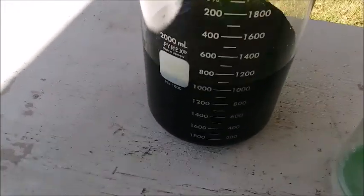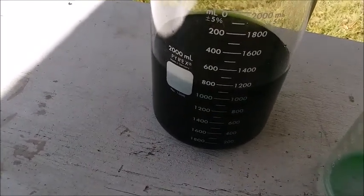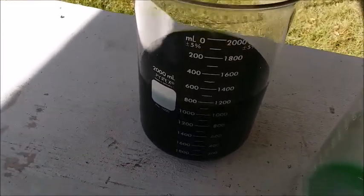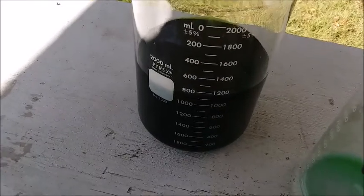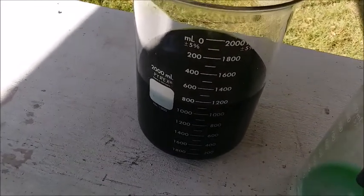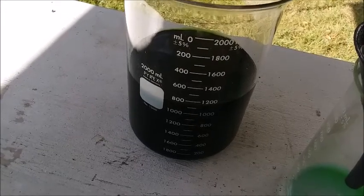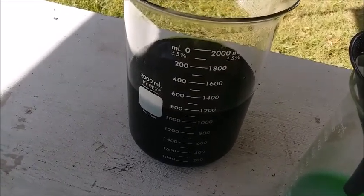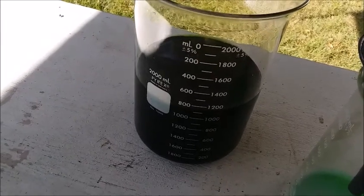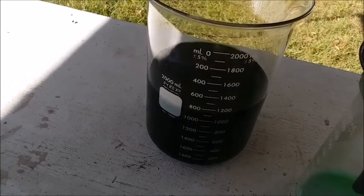I'll keep spritzing the filter until it turns white again and I get rid of all that green color. Now, this liquid — don't throw it away. A couple reasons. Number one, it's toxic waste. Number two, it's still active. You can use this liquid for your next batch of fingers, or even gold-plated pins. It's actually more active than it was when it was fresh, because the metal salts that are in it now are highly corrosive to the base metals that gold is plated on. I'm not sure how many times you can reuse this liquid, but if it seems like it's going a little slow, just throw a little more acid in it and maybe a splash of peroxide, and it rejuvenates it. So I'm not throwing this out. I'm going to keep it for my next batch.